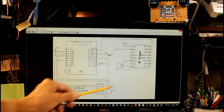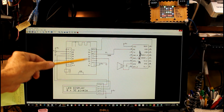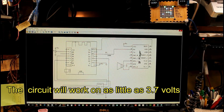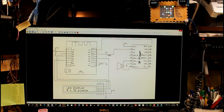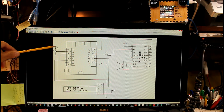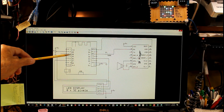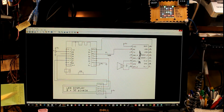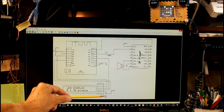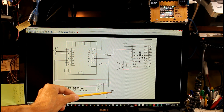Here's the schematic. There are three main parts. This is the ESP8266 WeMOS — not too many connections. It wants five volts, which can come from USB, a separate five-volt power supply, or a five-volt USB charger. It connects to a potentiometer that also goes to five volts and ground, and that potentiometer connects to pin A0 — analog to digital zero — which allows you to adjust the brightness. Three pins connect down to the LED display, and there are five connections total to the LED display: three from the ESP8266 plus ground and five volts.